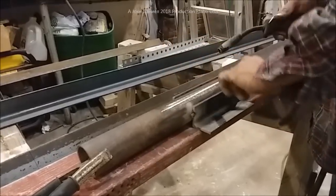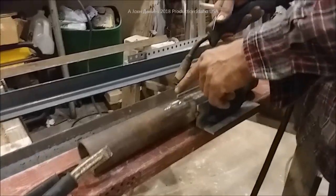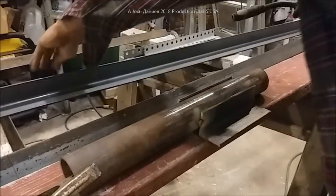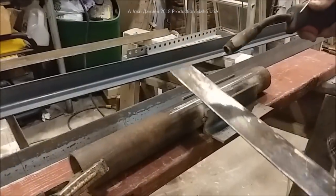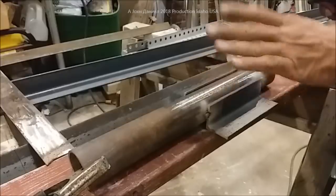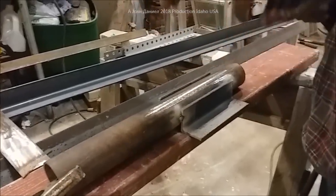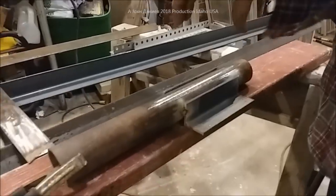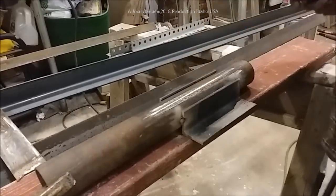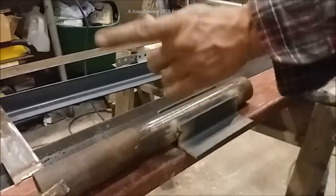I'm going to tag weld them on both ends, then fill weld, and put a piece of plate across the back to tie them all together — it'll be very strong. The trailer frame is quarter-inch, two-and-a-half by six-inch box frame, so it's going to be very strong for this. It will hold up with the trailer being towed down the road, and we'll be fine with a 22-pound turbine hanging on top.